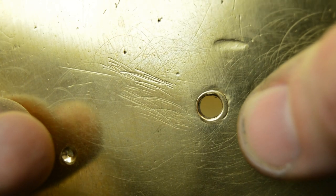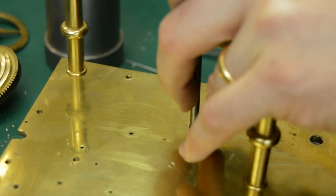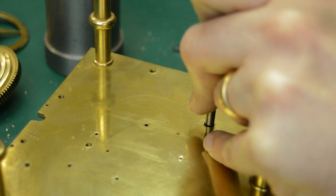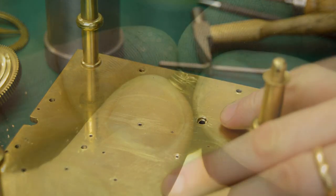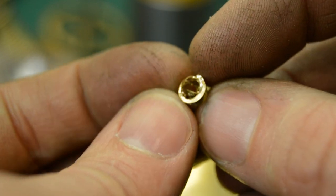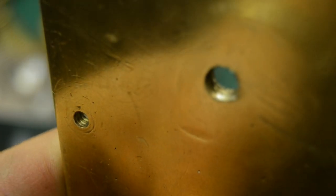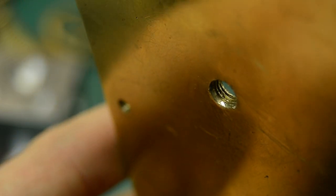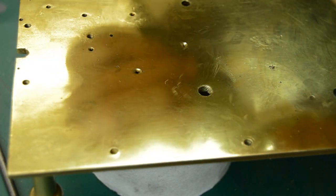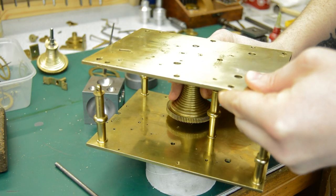The first thing I'm going to do is get rid of the old bush and see what we're left with. The surprise was that it's had a plug threaded in — they've actually tapped the plate and then put probably a brass bolt or something in. I don't think this is actually a commercially available brass bush that screws in; I think this is just a process that somebody has used to hold the bush in. It's not the nicest way of doing it, and it's not the way I will be doing it.